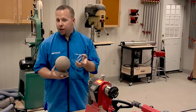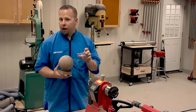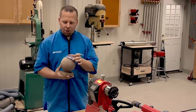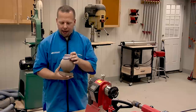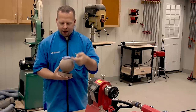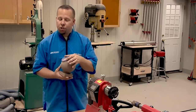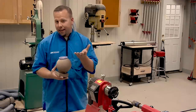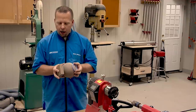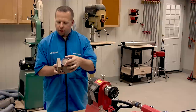I actually make my own rings, and I make them for a couple of reasons. I want to guarantee that it's perfectly round, that it's not stamped and slightly oval. I want to guarantee that it has a shape that's useful. And so by having a very crisp corner on the ring where the inside meets the outside, it allows me to see variations much easier than if it were a straight-sided cylinder. And I can shape the outside so that if I'm working up against another detail, I can use the ring pretty close to another detail.